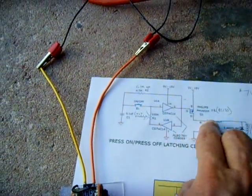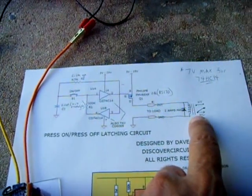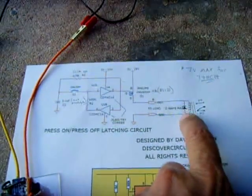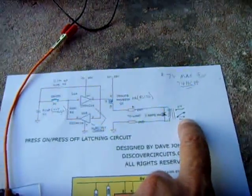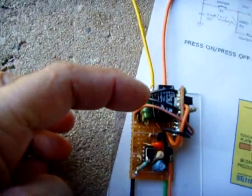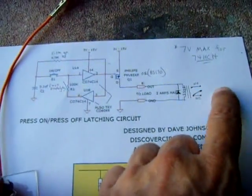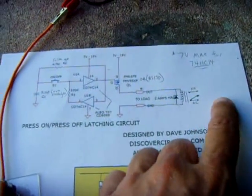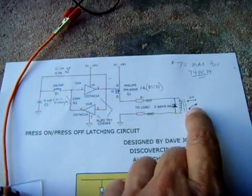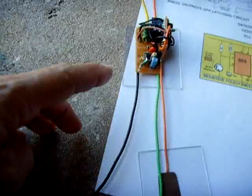This side of the circuit going into the MOSFET I left alone — it has the full 12 volts going into it. It feeds through the MOSFET and into a relay with another back-EMF diode across it. The contacts on this relay can handle about five amps, so you could put anything on this side of the coil: 12 volts, 240, 120, whatever you want, and have it activate and deactivate.